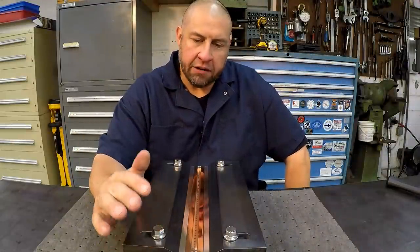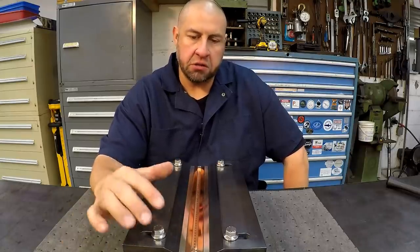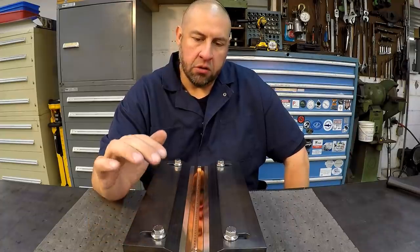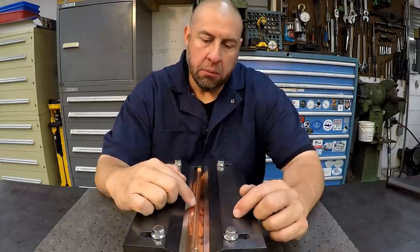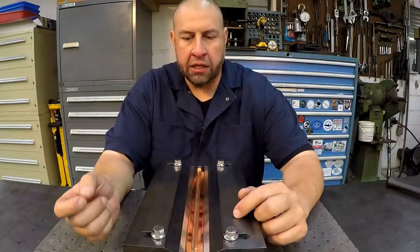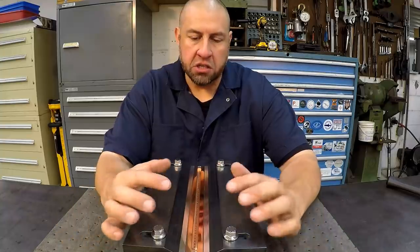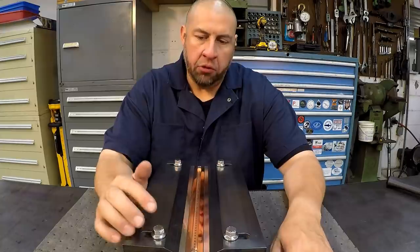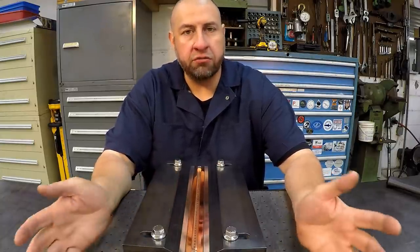So I've had a lot of comments, both in the videos and the Instagram feeds, showing the pictures of this. A lot of people not understanding what this is or how it's used. What this is, is a welding fixture that purges the backside of a weld seam with argon. So it's mainly going to be used for just test welding. This isn't something that you're using for a specific welding procedure that's needed. I believe that Jody is wanting this for testing purposes, for his videos.